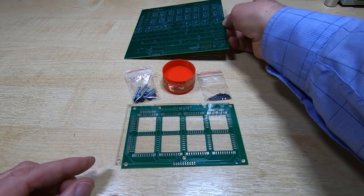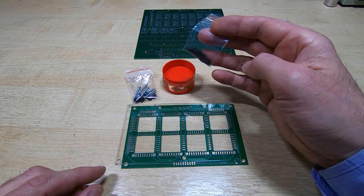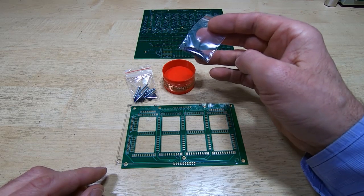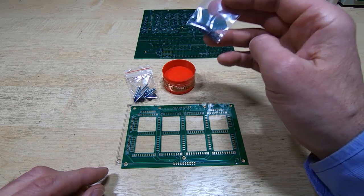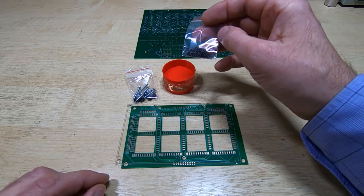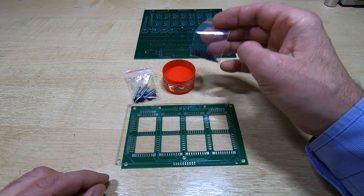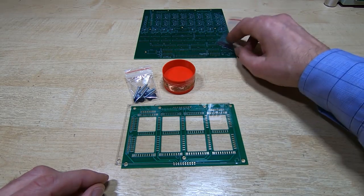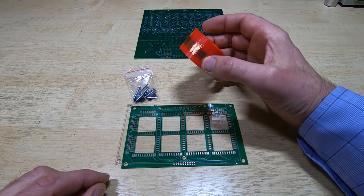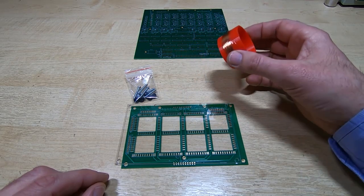So there'll be a main board and a set of ferrite cores — these are square loop ferrite cores suitable for the particular values shown in the book and in the videos. If you wanted to, you could in theory use this system to drive an older array that you happen to have lying around, but you would probably need to change the timing and the drive current components. There's also some wire — I'll come back to that in a few minutes — this is solderable enameled copper wire of the correct diameter for this design using this core size.